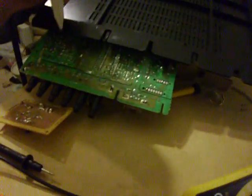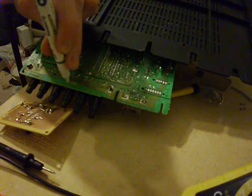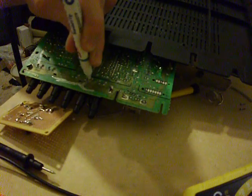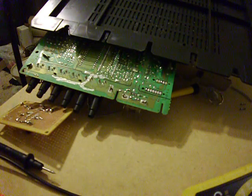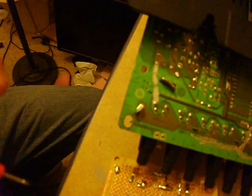If I had the micro tip it would work much better than the standard tip. But you can pretty much put traces anywhere you want to paint it onto. If you want to make different designs and prototype, the conductive pen can do all kinds of things. Now if this is an actual valid board, once that dried, everything in this little area is now connected. So you want to be careful when you're using this. When it's dry, you can take it and scratch off the areas that you don't want connected without any problems.